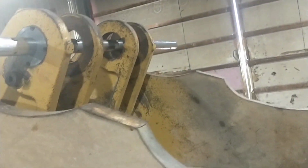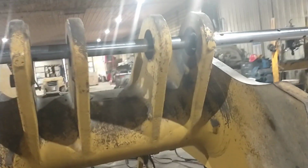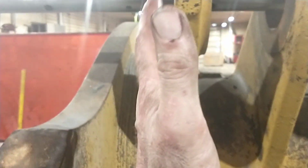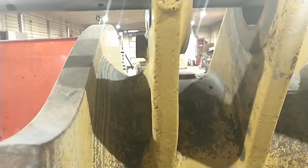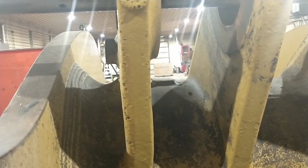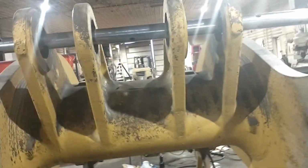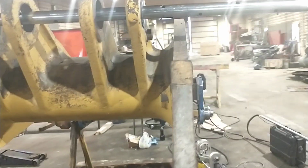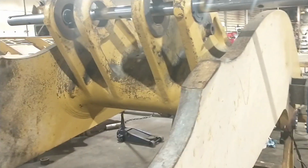Past experience has taught me that it really screws with getting properly centered up if you use lineup cones, because you don't have a flat face, you get, I don't know what to call it, parallax. But at any rate, you'll end up not on the actual center line. Now, if you knew it was going to move off center by some nice even amount, maybe you wouldn't care, but the problem is the casting can be different between the two sides, so you end up cockeyed.